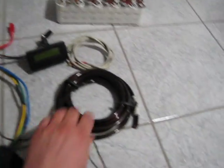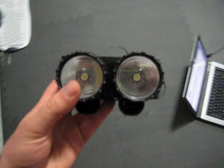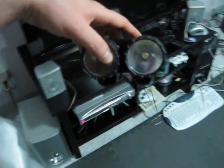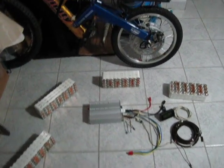I have pretty much everything done; the only other thing is getting it on the bike. The last thing I'll show you — which I've shown on other videos — is my headlamp. 1800 lumens on a CPU heat sink with a custom mount I made on the bottom. The clamp is the bottom of two cheap flashlights off eBay that I demolished and repurposed. It mounts to the front of my bike and runs off 3.3 volts, drawing about 2.8 amps each at 3.3 volts. I hope you enjoy all the stuff I've done — please let me know your thoughts. Thank you very much — Steve is out.